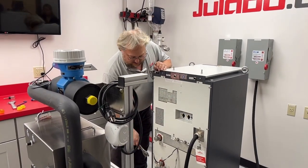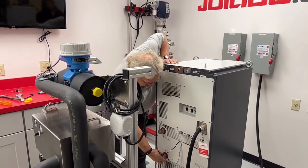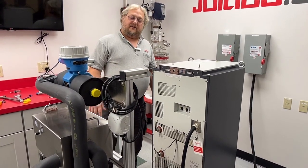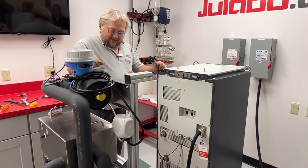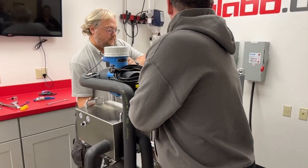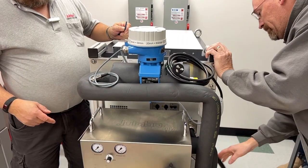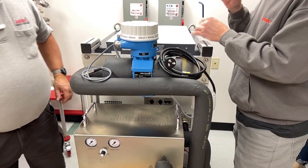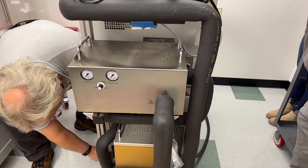Remove the protective cap nuts from the fittings for the pump connections. Then using a 36mm wrench, remove the cap nuts from the rear of the W50 in this case. If you don't have a lifting mechanism that will go low enough, you'll have to have a helper to lift the flow control rack and install it on the Presto. Tighten the top screws with a 6mm Allen wrench and then install the bottom screws.